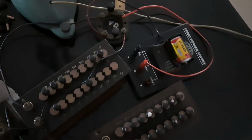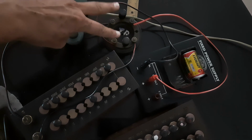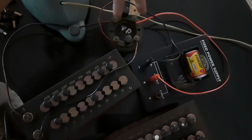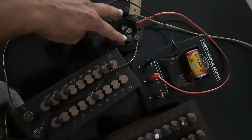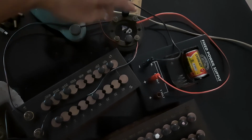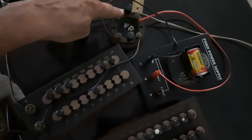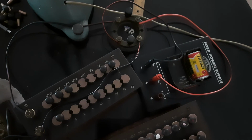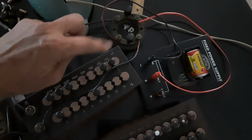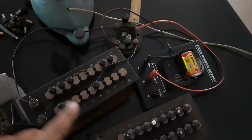It is a 4-way key where you have to plug the two keys into the other two holes, that is this one. So the plug-in keys will always be in opposite fashion, either this in front of two holes or this in front of two holes. Basically, this four terminal key is known as a commutator. It helps us to change the direction of the current which is passing through the ballistic galvanometer or the mirror galvanometer. This is your Q.